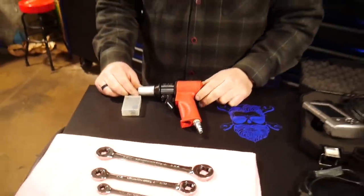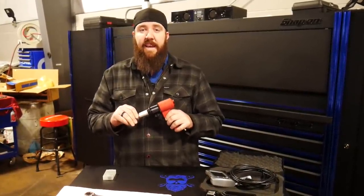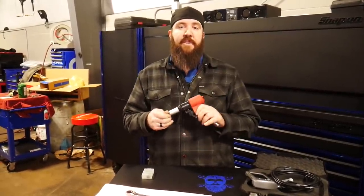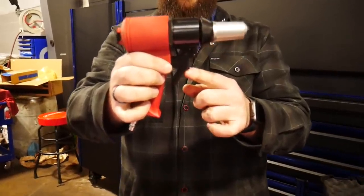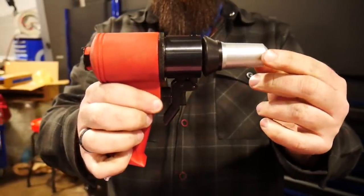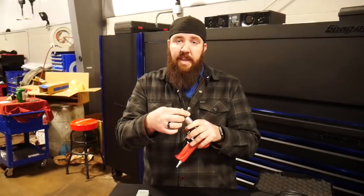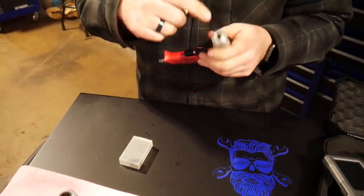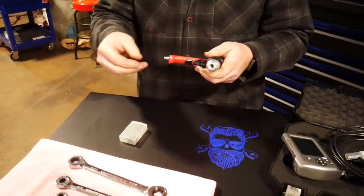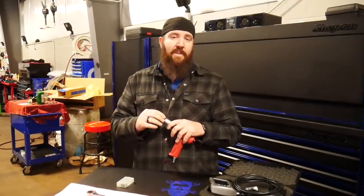Third on our list we've got our HUK AK-175 pneumatic rivet tool. This one is on the pricier side, running right around $300 from different vendors, but for you guys who do rivets all day long, this is a powerhouse able to take all the beating you need. It has an adjustable air check on the back. It has a dual stage trigger — the upper trigger uses pneumatic power to pull the rivet through, and the lower trigger releases the pneumatic pressure after it extends. The tips on the end are interchangeable and it comes with three different tips for different size rivets.